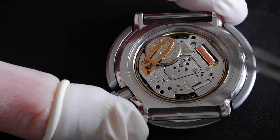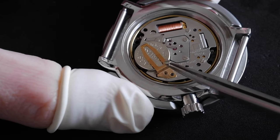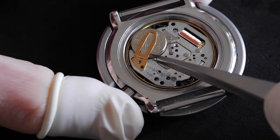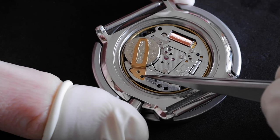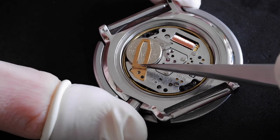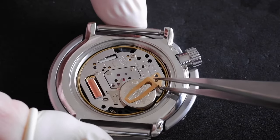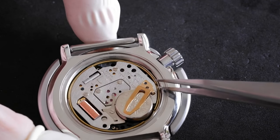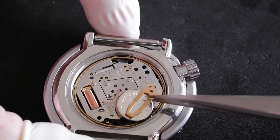As well as fine screwdrivers you'll also need fine tweezers. Now we can pull off the battery cover - it's attached and sort of pressed into a small dimple, so we just need to gently lift that off. It's held on with friction so it will come off, just need to be careful. These tweezers are also sharp and will scratch the movement so I've got to be very careful.